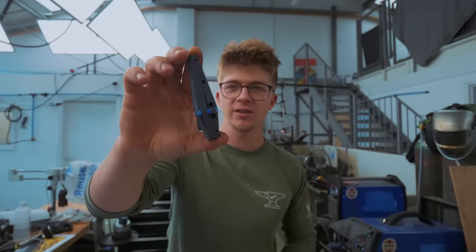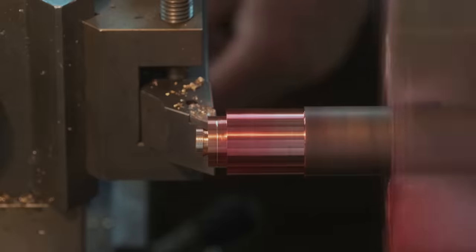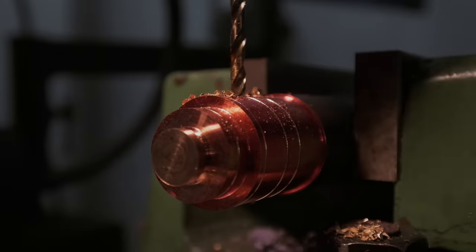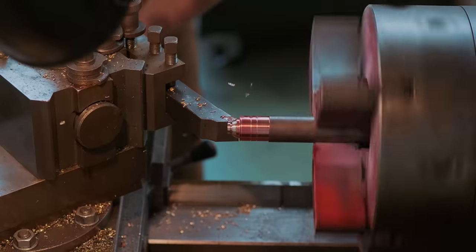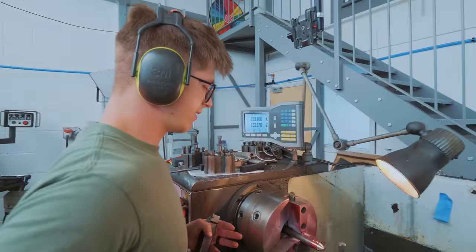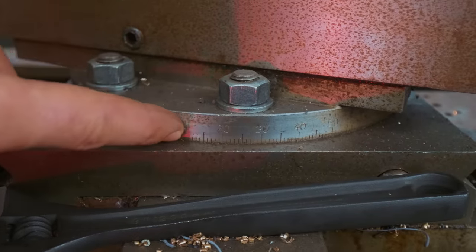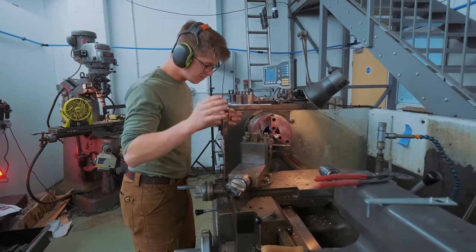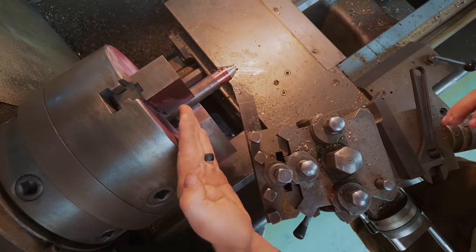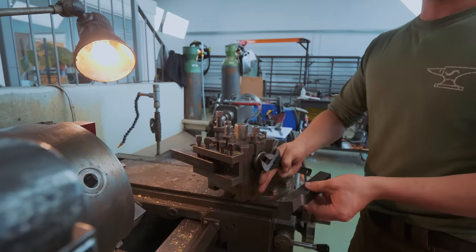Look at that - that is pretty successful! Almost 26 hours has gone. The blade is in the tempering oven, we've begun roughing in our handle octagons, and we will now head to the lathe to begin roughing in our pommel. This part has two tapers - we've cut our first taper by tilting the compound, which is how we know the angles we're hitting. When we have it all tilted we end up with an access problem, so instead of using a right-hand cutter I'll use a left-hand cutter and plop it into the other side of the tool holding setup.